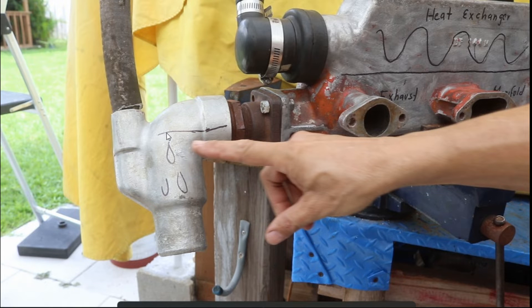This imaginary line is the water line you need to take into consideration to determine whether the engine is located below or above it. If the engine is located above the water line, you can install a small hose between this point and this point. If the engine is located below the water line, you need to install this hose higher, passing one foot over the level of the water line and returning into this elbow.